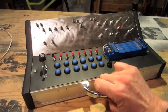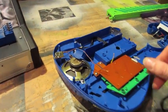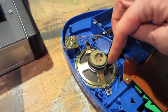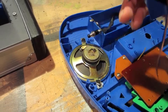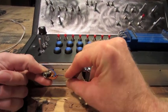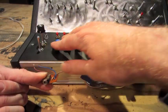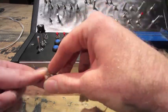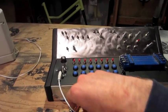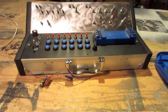Okay, well, I'm just about done with my little synthesizer here, and I had one last idea. On the stock guitar, it had this little circuit. Basically, you plug headphones in and it shuts off the speaker. So what I'm going to do is take this little plug, probably widen up one of these holes, mount it in there, and wire it in a way that when you plug this in, it basically kills the toy guitar, and then you could input something in, like a stylophone, and then that audio would route through the effects. Just kind of a little last minute thing I thought of right now.